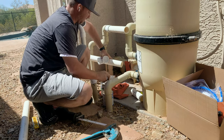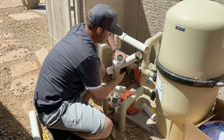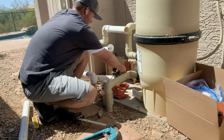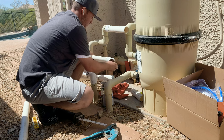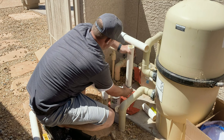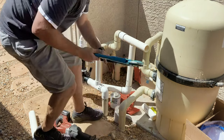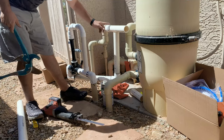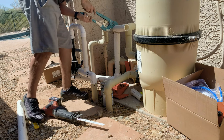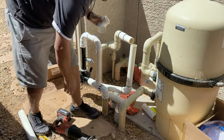So I cleaned all my pipes. So what I want to do is clean this one and then glue this one, glue these together. Glue this one, glue it together, pop it up underneath where I'm going to go. Sweet. So now the inside of this pipe where these two meet is my cut joint. So I'm going to cut right there. Take one more 90.